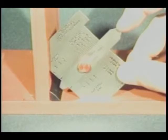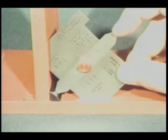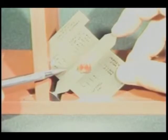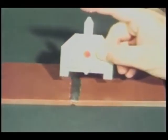Again, place the 45-degree bevel of the gauge against the adjoining plate surfaces to measure the permissible fillet weld convexity. Lower the slide to the weld throat and read the maximum convexity from this scale. Finally, let's measure the reinforcement of a butt weld.